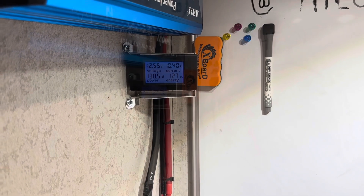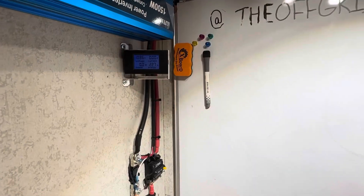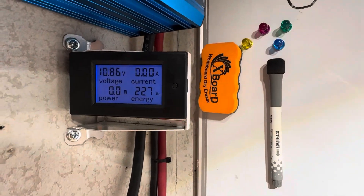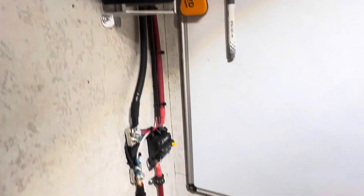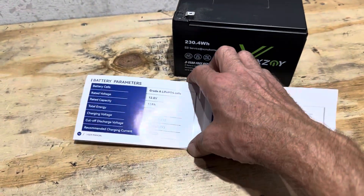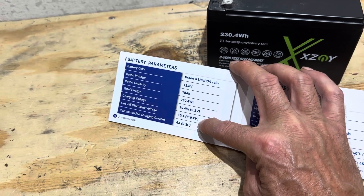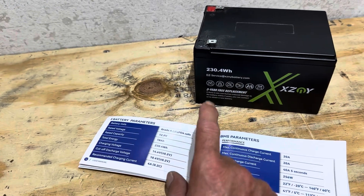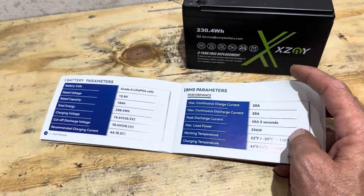I'll leave it right there for the rest of the test. The voltage on the battery is starting to flatline, so it's probably going to drop out any second now. I almost made it to its mark — and there we went. The BMS tripped on low voltage. Let it reset — roughly three minutes and the BMS reset itself. So there we are: 10.86 volts after the BMS came back on, and 227 watt hours — just a tick below its rating. I had to go find my little manual here. That is the 18 amp hour manual for the battery that was in that ammo can. So there's the specs: 18 amp hours, 230.4 watt hours, recommended charge of 4 amps (0.2C). If I would have discharged it at that 0.2C rate, I'd probably have gotten the full capacity. Max charge and discharge of 20 amps, and peak discharge 40 amps for 5 seconds.